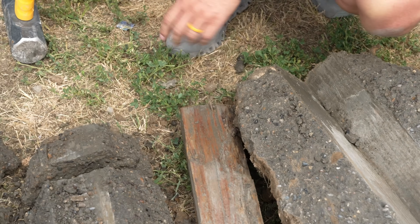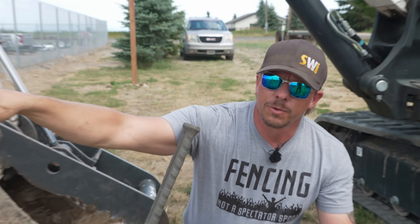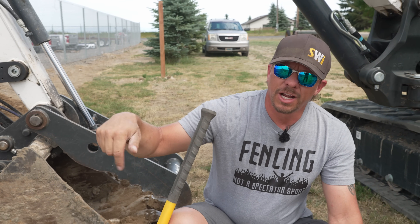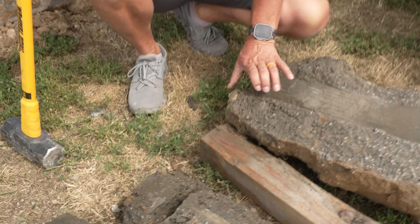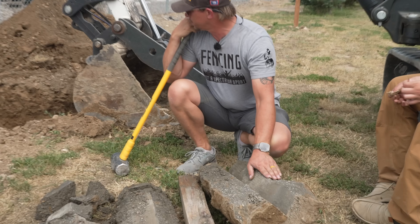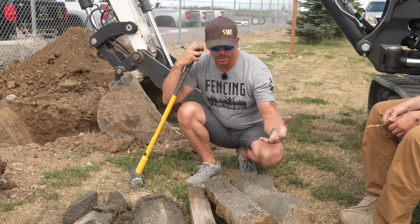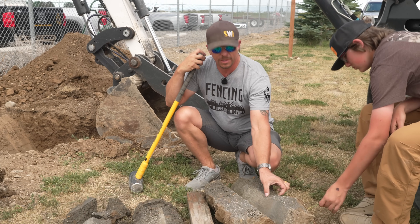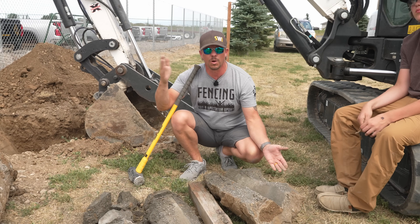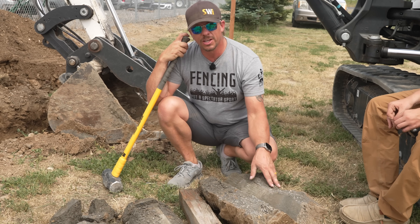Something else I'm noticing is that this post is soaking wet and the ground is a lot wetter this time. We have a burn pit nearby where we burn wood and cardboard, and that pit actually has water in it from all the irrigating going on around us. Our water table has risen to about four feet below grade, which I think had an impact on how wet the bottom is. In conclusion on this one: yes, adding water to the top definitely made a difference, because without it the top soil stays really dry. But it really doesn't have much holding power — it's pretty weak. If a windstorm hit this, especially with thin concrete on the corners, that concrete would break and you'd have a loose, wobbly post inside your concrete foundation, and we're only 32 inches in the ground.